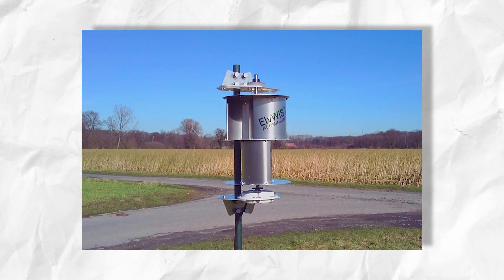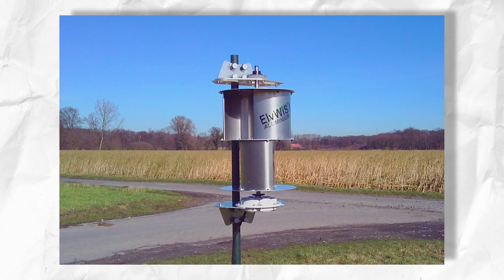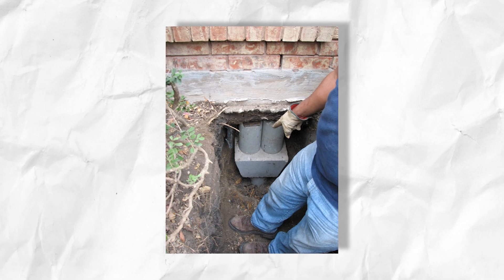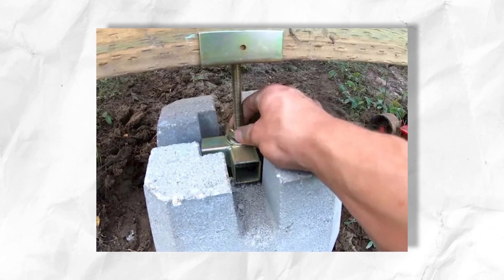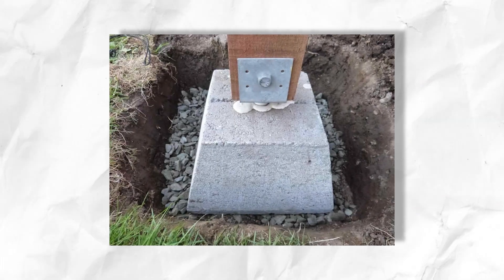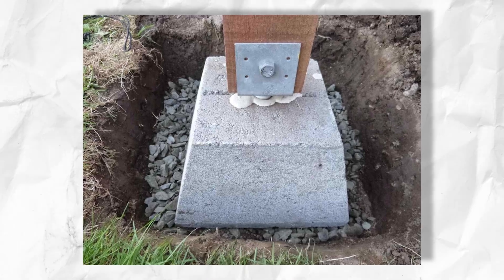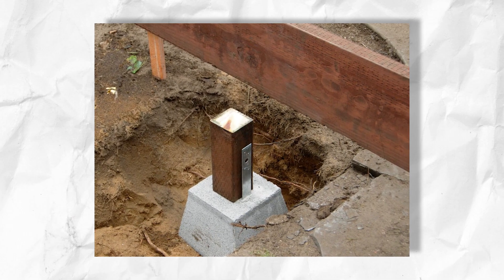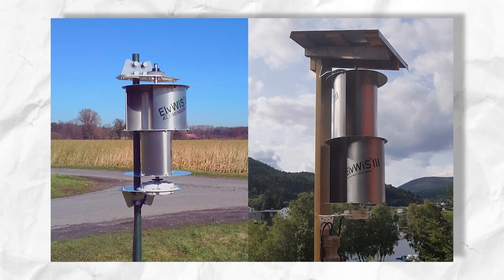The gin pole is situated at an angle against the top of the tower, with rope pulleys redirecting the hoist force provided by a come-along winch tool, also rented from a rental equipment provider. Rather than excavating for an expensive poured concrete anchor base requiring specialty contracting equipment, the homeowner chose a surface mount solution using concrete piers. After leveling and aligning the tower position, auger drilling created holes for 5 pier blocks arranged in an X pattern, which were backfilled with cement and gravel mixtures. Steel rebar reinforced the curing concrete piers, penetrating deep into the ground with J-bolts bent upward to connect mounting plates at the base of each tower leg. Quality inspections verified sufficient concrete curing and structural integrity before mounting the turbine.